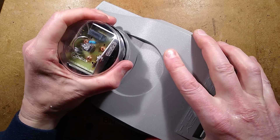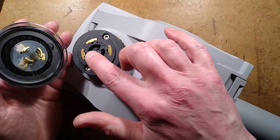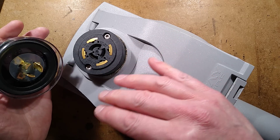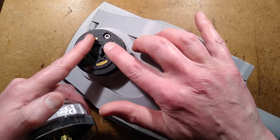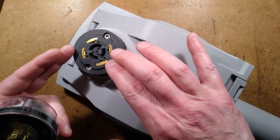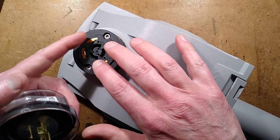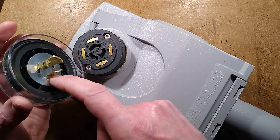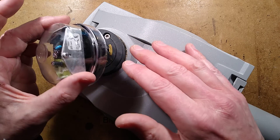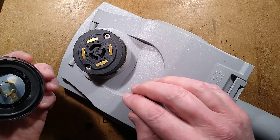On the other side we have a Zodion dusk sensor, a basic one just with three connections. This is a NEMA socket. The NEMA socket traditionally just had three pins — live, neutral, and switch live — but the new ones have the extra four pins exposed in the top here, which are for Smart City and DALI. This one is wired to use the DALI if used, but it's not used in this one. The exposed pins wouldn't give you a shock if powered because the DALI is powered from the controller — a small power supply that sends the signal back down into the unit.